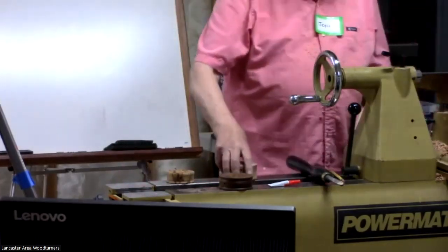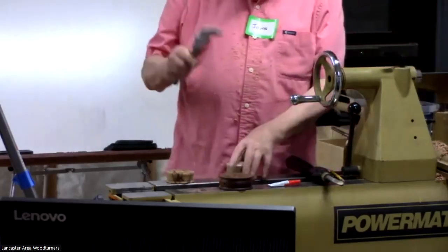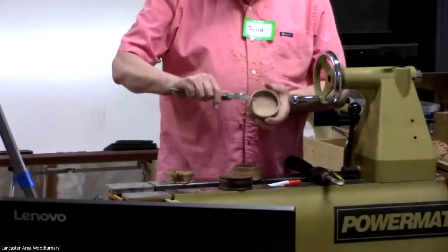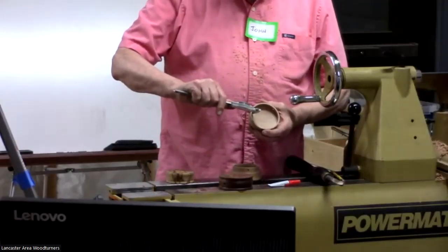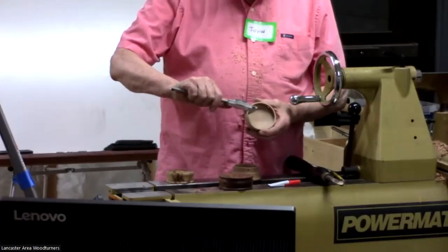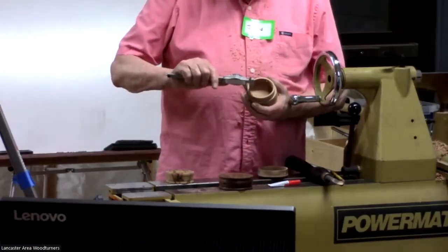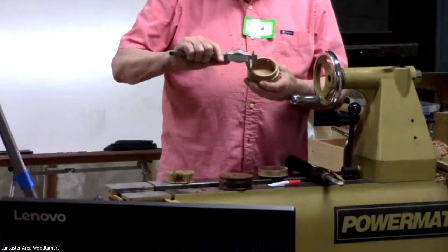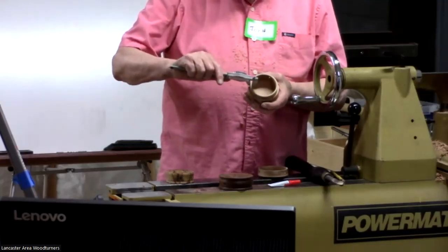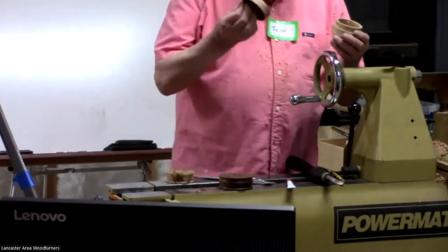First of all, I want to know how thick that is. Vernier caliper, plastic vernier caliper. And I learned that this is over an eighth and it's under 3/16. I actually have magnets that are 5/32 and a tenth, and they've got a lot of sizes, and I've got them all. And over here it's 3/16, which is what I want. So I can put a 3/16 magnet in here and an eighth magnet in here.